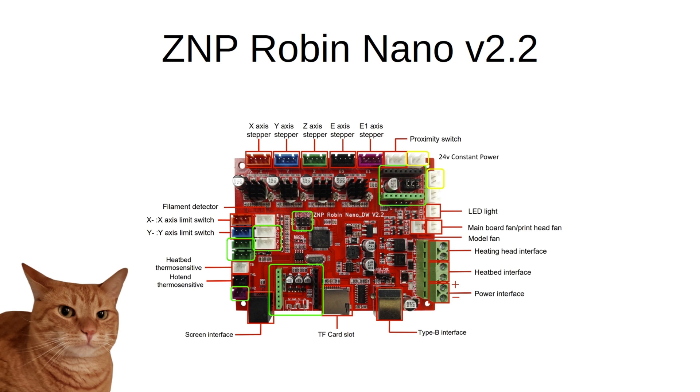On the top right of the photo, you'll see two yellow boxes marked 24-volt constant power. These are helpful when you need to source power for a device such as a BigTree Tech Pi. I have tried running 24-volt LED strip lighting with these ports, however, and they just don't seem to have a steady enough stream of 24-volt power for the lighting — they tend to flicker a little bit. I think they may need some sort of inline capacitors to smooth out the current going through them.